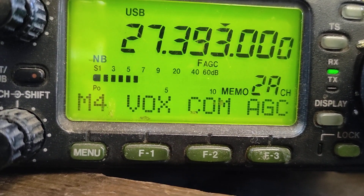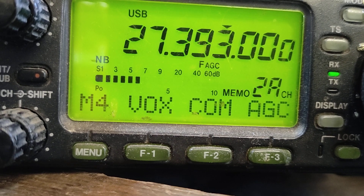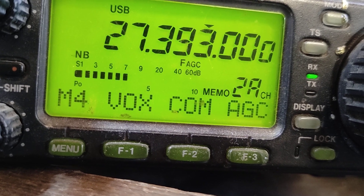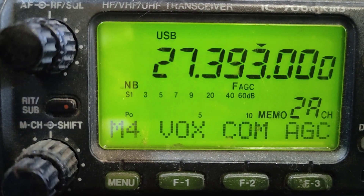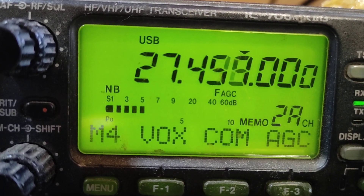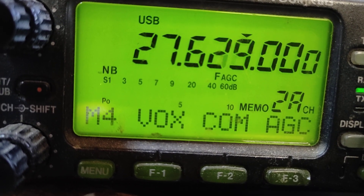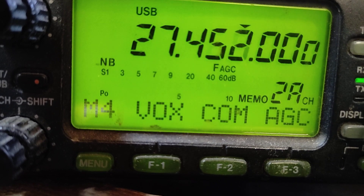I'm concentrating on 27 MHz. There's a lot of guys out there running CB and it's going to help a lot of people. Let's go back outside and reintroduce the common mode choke and then we can see if there's any difference in the noise. Right, we're back at the receiver. You can see there's a big difference - it's gone from an S7 to 0. We've still got the antenna plugged in. I can actually receive signals now if there's anything on the band.